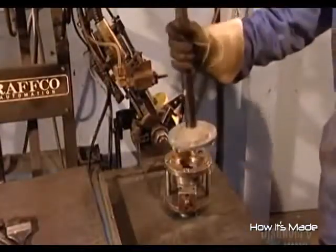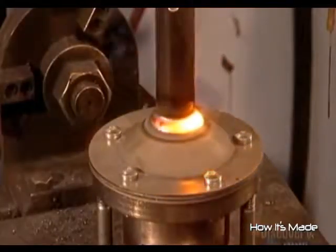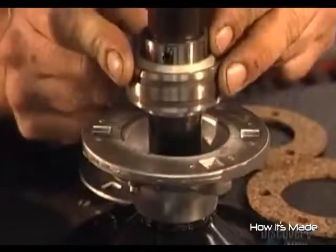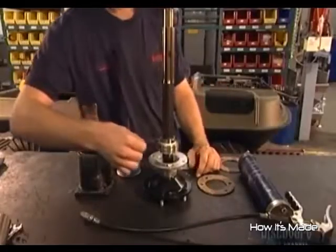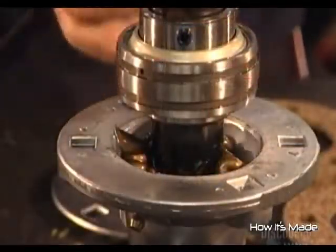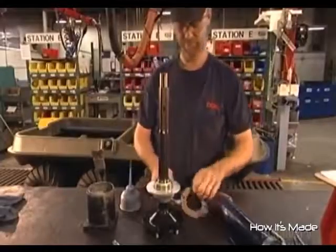After he flips it, the machine welds the shaft to the hub's other side. This company uses a robot for this important step because it's faster and more precise. A worker then reveals some of the vehicle's secrets to functioning in water: each axle's bearing has rubber and steel collars called flanges, which form a waterproof seal over the axle.